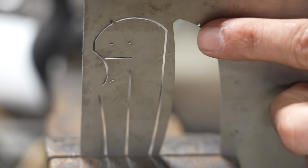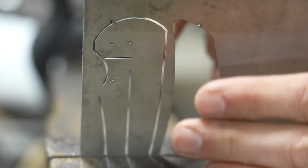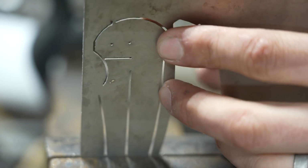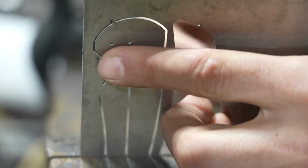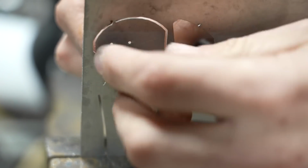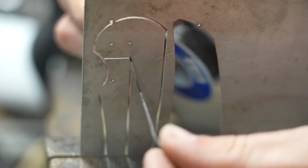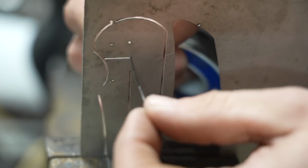All right, so here is a failed water jet part that I misdrew on the computer, but we're gonna pretend that this is exactly what it's supposed to look like with these notches and cutouts and holes. Now, if this was our finished part and I needed to get in there and do any finishing on these, it would be almost impossible to get a file in there. These are very small holes, and the only abrasive cord that I can fit through it is my 0.8 millimeter cord. But look at the way I have access now to deburr and sand these features. There's really no other way other than using a micro size file to get in there and do that work.